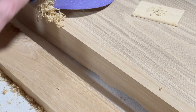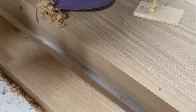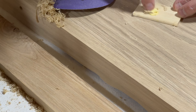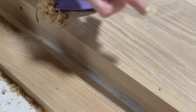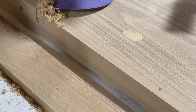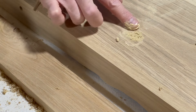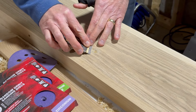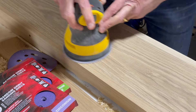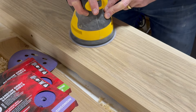So I've just noticed a tiny little nick in the front piece of oak - or it's a little dig - so I've just mixed some sawdust from the sanding bag with some wood glue and I would just apply that to the hole, let it dry, come back, sand it down. I'll scrape off the excess with a razor blade first of all and then give it a sanding. And just like magic, it's gone. Even I can't see where it was.